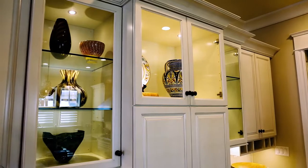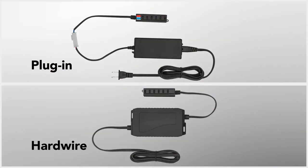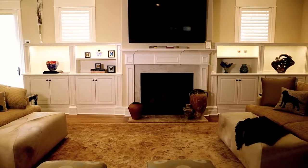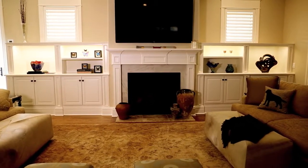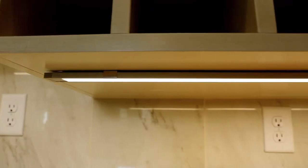Tresco offers two types of 12-volt power supplies: plug-in and hardwire. Hardwire power supplies are necessary only if you want to control your lights from a traditional hardwired wall dimmer. Both power supplies have no minimum load requirement.